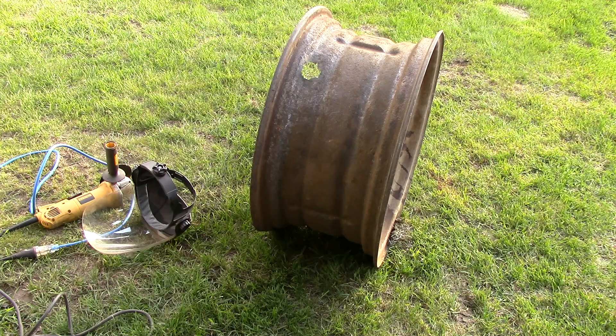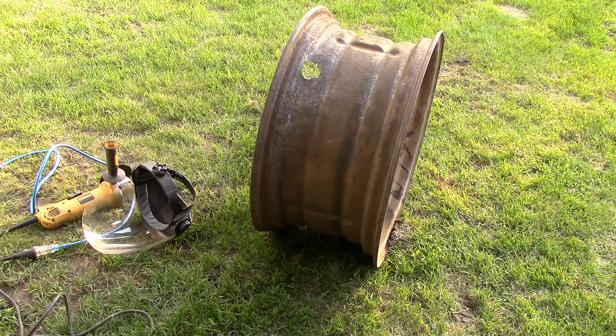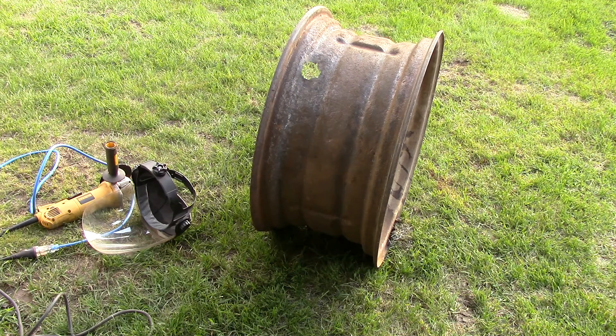You can see that I've used a black sharpie to mark out and lay out where I'm going to cut the section out of this wheel. While you're watching I will cut that out. Basically you want to go back until you get to good strong metal. You don't want to make replacement pieces up ahead of time until you know you're back far enough that you have good thick metal that you can weld to, otherwise you'll just end up making new pieces if you have to go back and cut further.